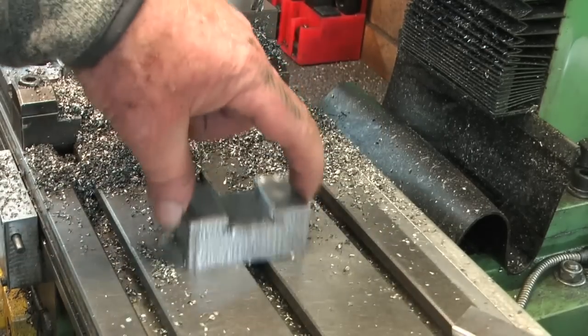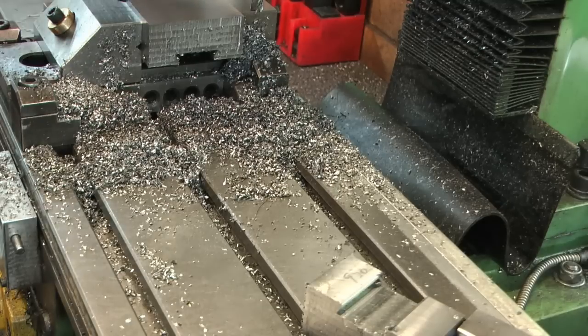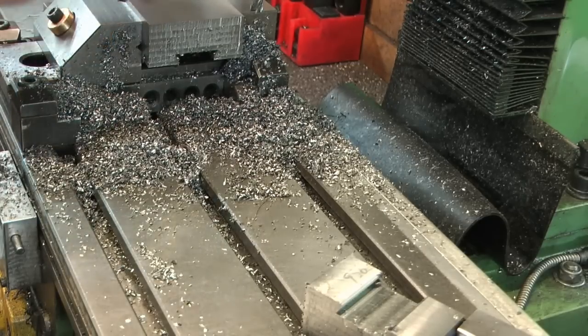There we are, that's the first two chopped off - that didn't take long. Back up with the fly cutter. I've just measured the step here - it's four mil, so I've got to take another three mil off here. I think I'll get the fly cutter up, take three mil off the top, and then there'll be less meat to cut through when I cut the others up.